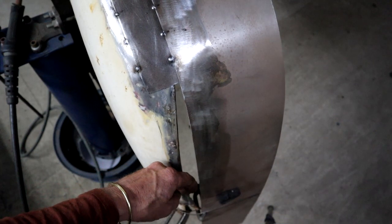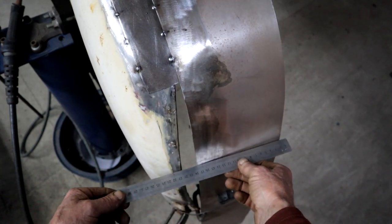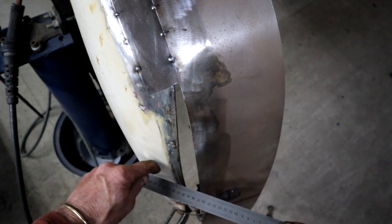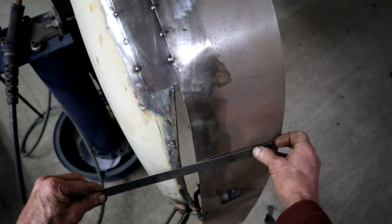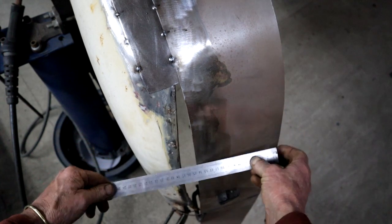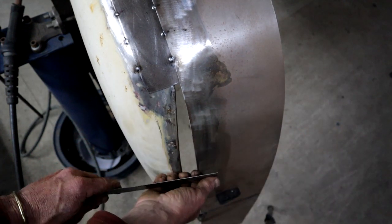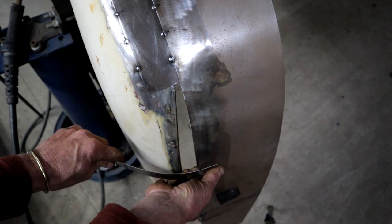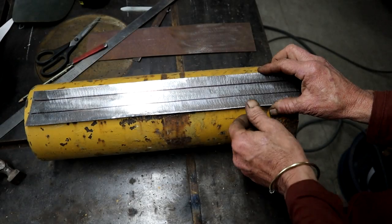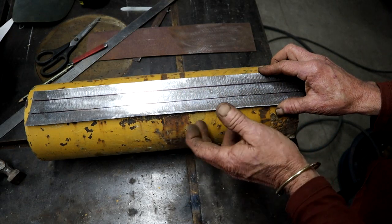So this should really be rolling into that surface, if I can put it like that. There's a straight, but this surface on this side is all curved. So in the ideal world, we would want something like that. So if I just put a flat piece of plate on here, it's not going to work well. So I need to pre-shape my piece of plate so it's got some curvature running this way. So like I said, I haven't got any fancy gear, like a slip roller would have been very nice for this. Or even an English wheel.